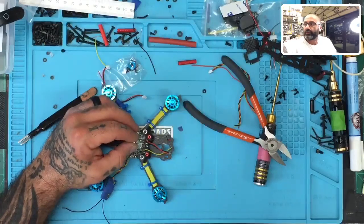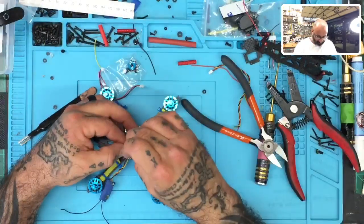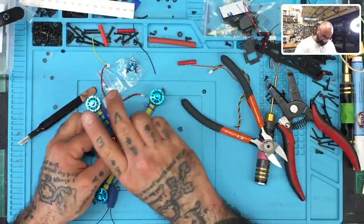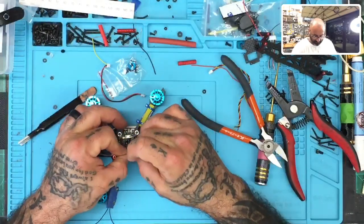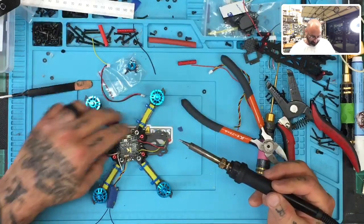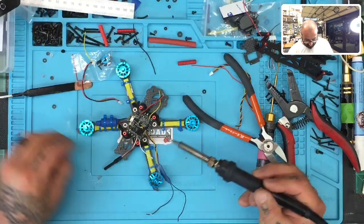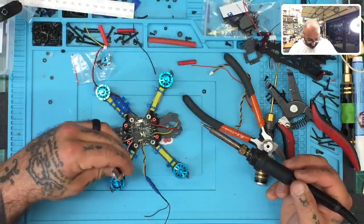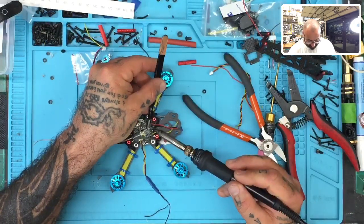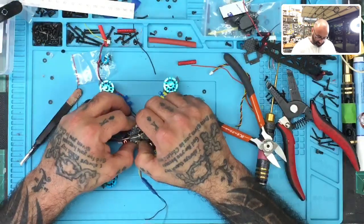Okay. Strip the wire. Twist it. Let's tin it. By putting the flux paste on there, let's tin it, and here we go. Okay, that being done, we're just going to go ahead now and very quickly and very easily just put this on pad three over here, and it's done, okay? That's it. We now have our smart audio in place.